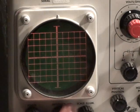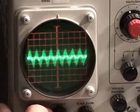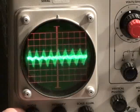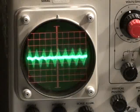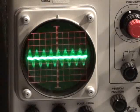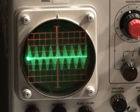We're zooming in on the screen — we're attached to the collector lead. Turn up the intensity a little bit on the scope so you can actually see it. We've got our focus pretty good. You have to follow a particular order: you have to start from the lower frequency to the highest frequency, which is simple on this chassis because the coils just follow that order as you go right up the line.